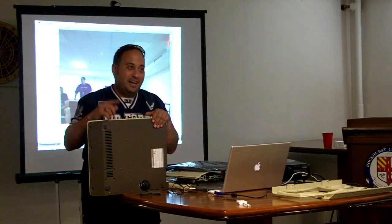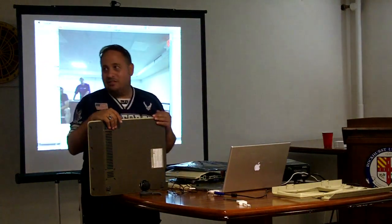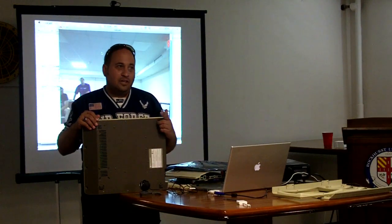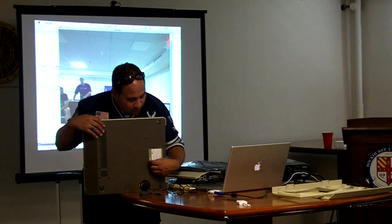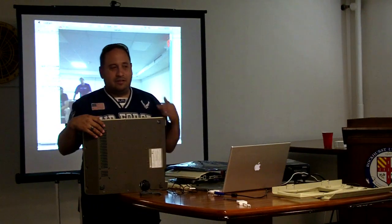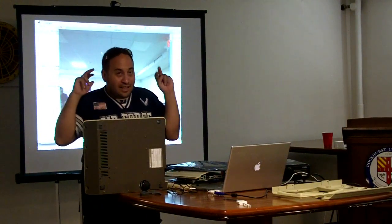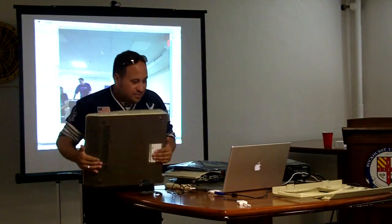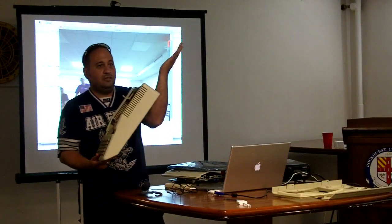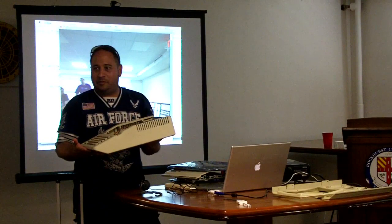I know how to look. Usually, you will see lines in them, any slight picking on the corners. These machines put these stickers on very straight. It shouldn't be moved. However, that doesn't mean that if you see a line of glue around two edges, someone peeled it. Think of putting down ceramic tile on top of wet concrete and it slides. These stickers slide. If this thing is sitting on top of something and it's hot, the sticker can slide on the glue. Generally, it only does it in one direction. So you have to be able to differentiate that from someone peeling it up.